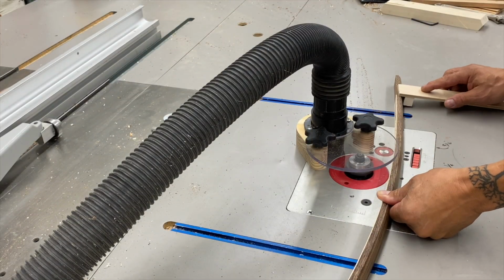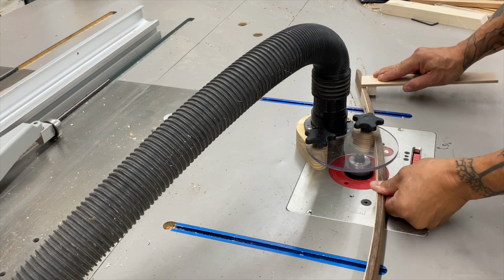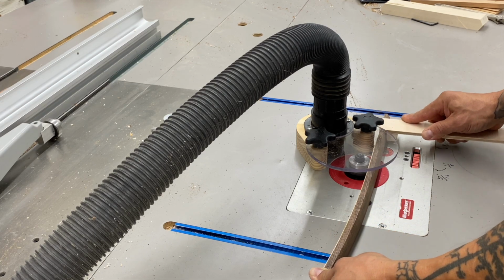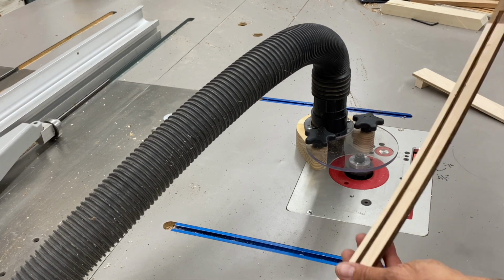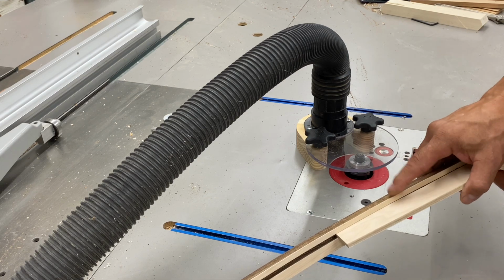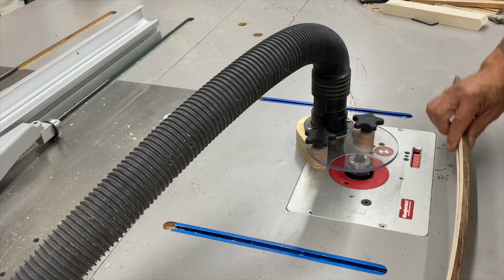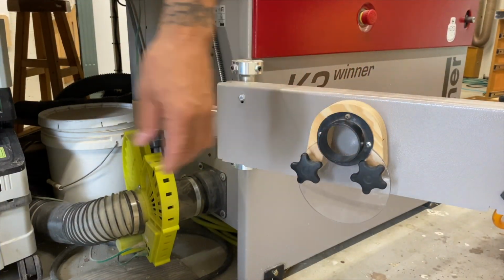So similar to a starter pin, this has a starting surface, right? I can first make contact with the right side of the jig and then use leverage to ease it into the router bit. I added a chunk of clear Lexan for added safety and improved vacuum. And my push stick serves mostly as a hold down, and I can pull it through with my left hand, keeping everything safe. And when not in use, this dude lives right there.